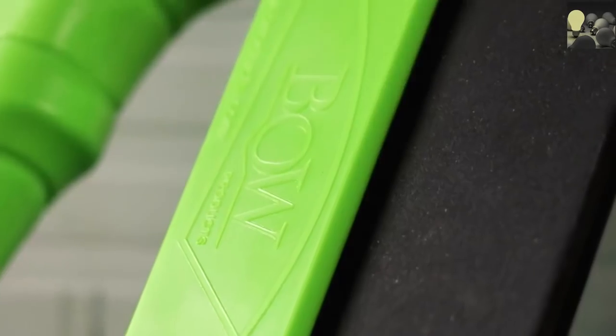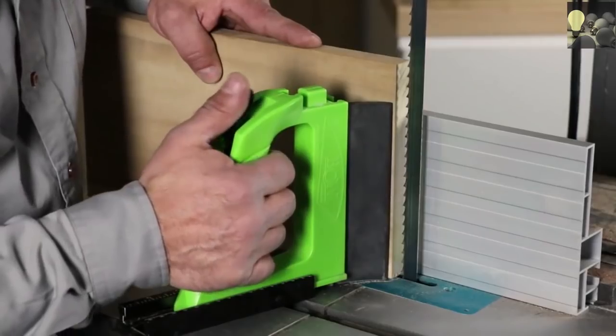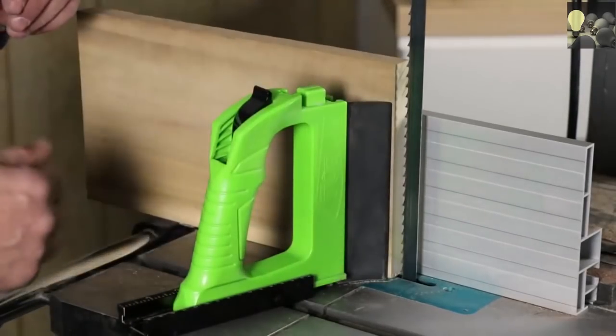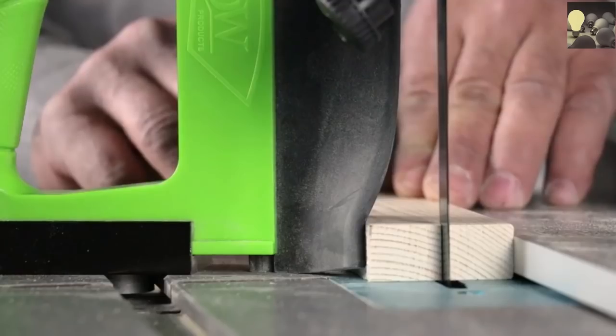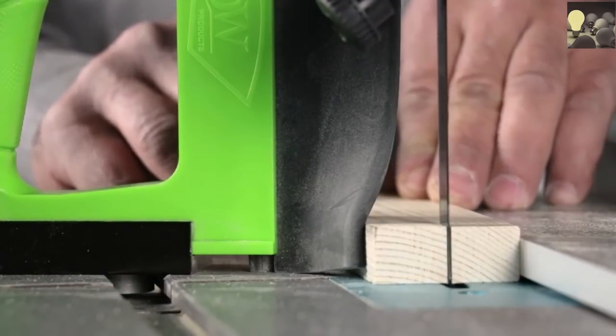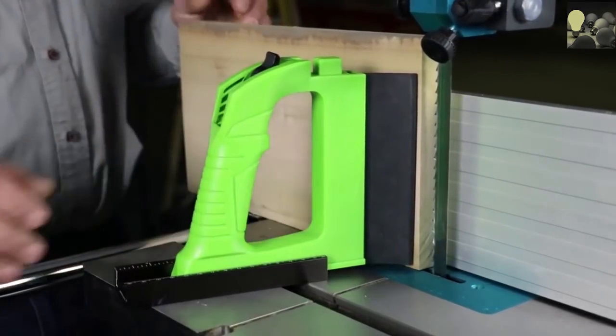The Guide Pro 6-inch silicone feather applies consistent vertical pressure along the leading edge of the workpiece. This ensures consistent contact between the saw's fence and the workpiece, resulting in a truly square cut. The flexible feather accommodates variations in shape and thickness, while the ergonomic handle helps you comfortably apply the desired pressure.